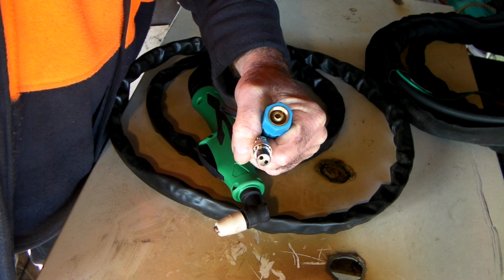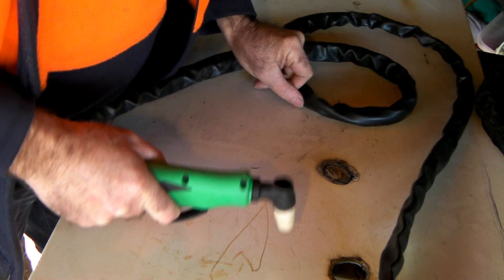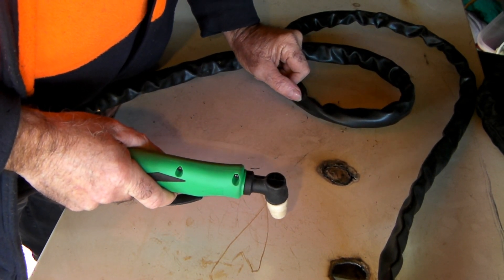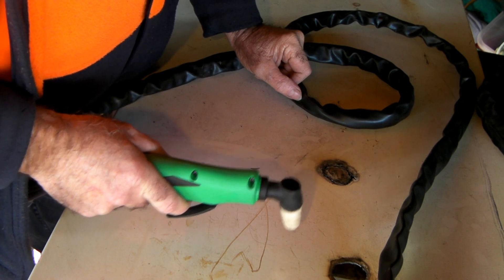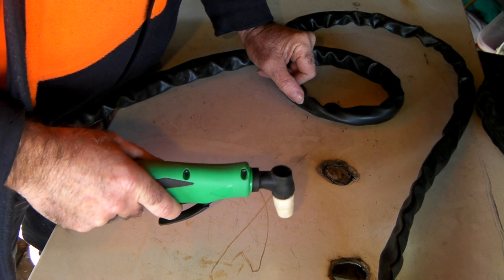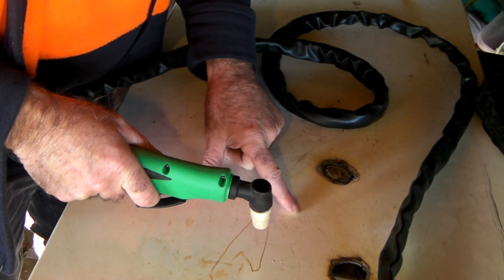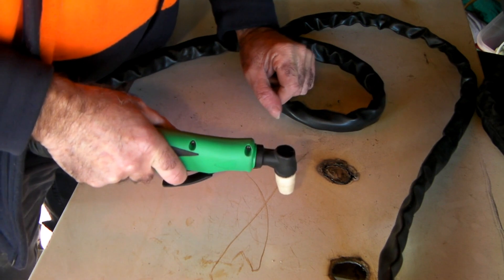I'll give you a demonstration of the two different sorts of torches and you can decide which one's best for you. Let's start with the touch torch, or a non-pilot arc torch. This is a good little torch. If you want to know any more about the non-pilot arc or the pilot arc stuff I'll drop a whole lot of links in the description below. Now the only thing with these is when you're starting on a painted surface they're quite hard to start, and you normally have to get an angle grinder or a piece of metal that's already had the paint stripped off to get the thing to start cutting.